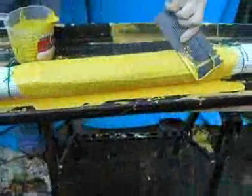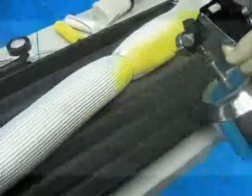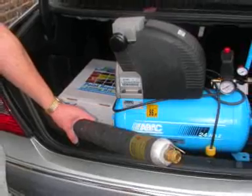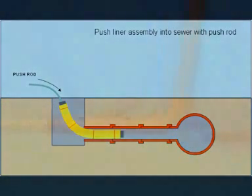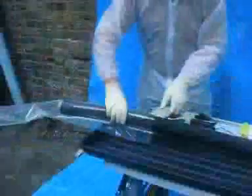The method is this simple. Apply a liquid resin onto a fiberglass tube either by spread painting or by spray application. Once applied, cast the wet fiberglass tube onto the defective pipe. EasyCast Liner requires no expensive equipment, with most of the equipment sufficiently portable enough for the work to be carried out from the trunk of a car. The method uses the age-old technique of casting a product between two formers or molds. The outer former is the old defective section of pipe; the inner former is an inflatable packer.